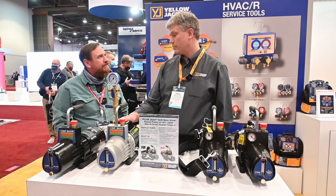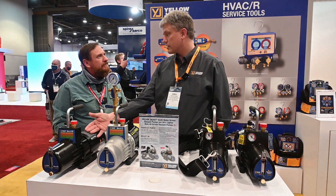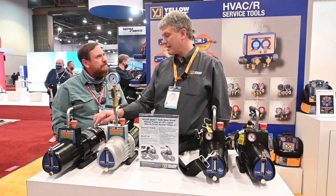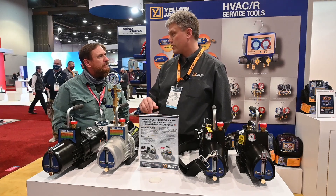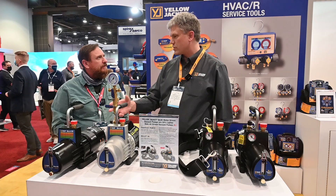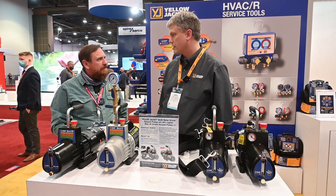The other really cool thing about the DC motor is we actually have a soft start capability. So if you were to lose power and you're under full vacuum, you're able to start this thing and pull back under full vacuum. We don't lose vacuum because of the technology in this pump, but you're able to pull it back down. Normally with an AC motor, you're doing a hard start — hitting it like a sledgehammer. On the DC one, it does a soft start, so it just ticks it basically until it breaks through and gets everything going again, which is basically that oil seal in the rotary vane pump. It gets it going and then it fires right off — you're back up and running. You've never lost your vacuum the entire time.